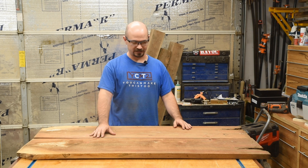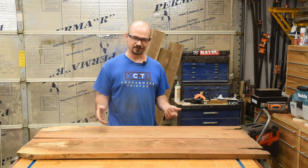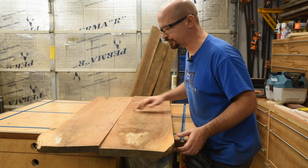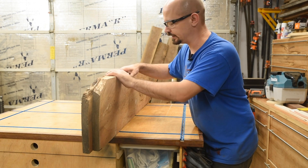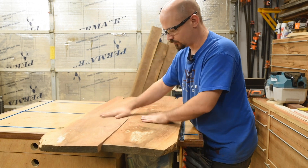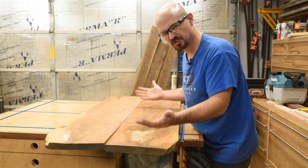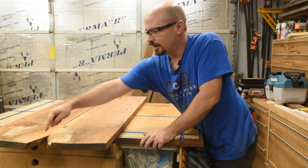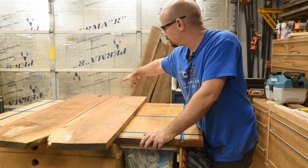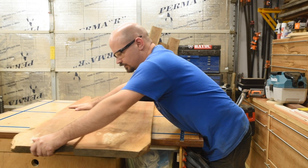I have these two walnut slabs I think are going to be nice. They're kind of rough and I haven't decided how I'm going to deal with that yet. I think this will be nice because they were bookmatched — which means that in the log they were together like this. You can see how everything lines up, then it was split, so these two sides are pretty good mirror images of each other, so I want to keep them in this orientation. It's going to look the best. They also mirror each other the other way, but not as well, because of this V here and the way the rot down there lines up — I don't care for that look as much.